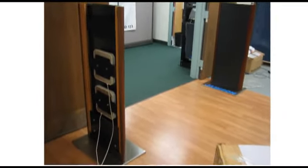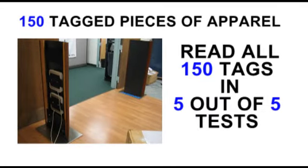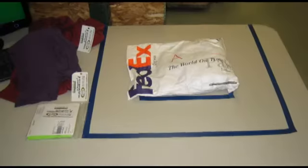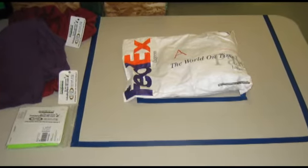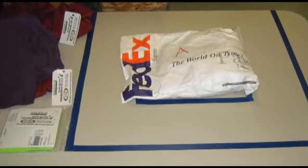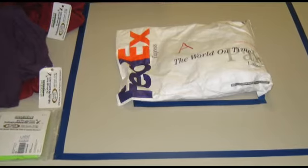For our portal tests, our team created a scenario replicating the front of a retail store with two doors. In RFID-enabled retail environments, tagged inventory is read automatically as it's received, eliminating the need for staff to scan new stock manually with barcode guns. We tested 150 tagged pieces of apparel in boxes on a hand truck, and the Speedway Revolution read all 150 tags pushed through the door in 5 out of 5 tests. In 45 different test cases — including tagged apparel in boxes and pouches on an RFID-enabled table — the Speedway Revolution did not miss a single tag.